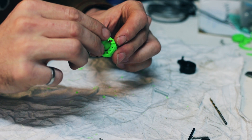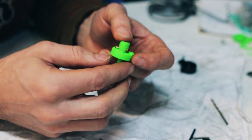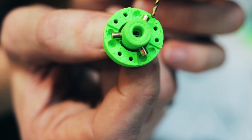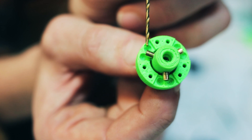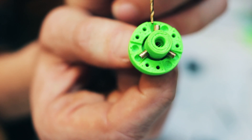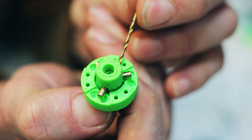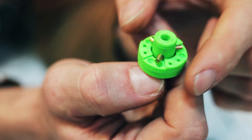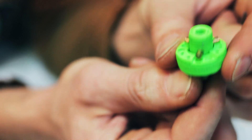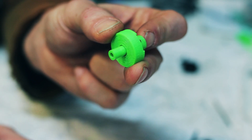What it does is it goes inside of this guy, and in between these ball pits is where this contact is going to sit. It bridges between these two balls and completes the electrical connection so that it can go around to this one. Right here is where I'm going to split the contacts, so then it becomes six series contacts all in a row, so that if you break any one of them by moving the probe, the electrical connection is broken — which is why it works so beautifully and why such small movements cause it to be tripped.